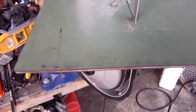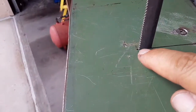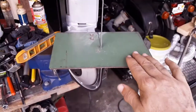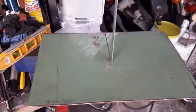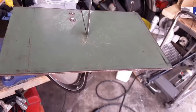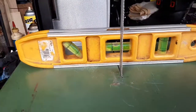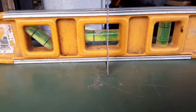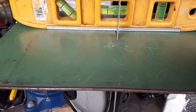There you go — you can see the blade comes right to the edge. So now as you can see, you've got a nice little work table for your material. Let me put the level back on and see what we got. Side to side — you can see the bubble is almost outside the left line, which tells you that everything is leaning this way. So if you lift it up just a hair — not even a sixteenth of an inch.